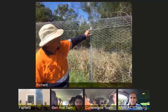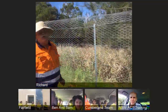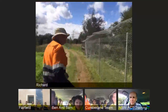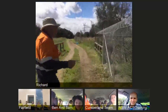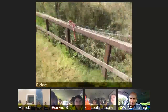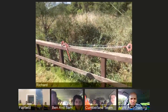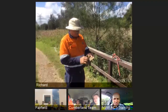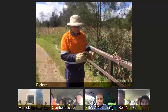The top and the bottom wires are 1.8 metres apart to take our netting. We use gripples to hold the wires together. A gripple is a mechanism of tying two wires together - the wire will move one way through the gripple and not the other. We're also using common wire tensioners. Whenever we're using wire under tension, in case it breaks and snaps back, we make sure that we have at least a five metre radius of people clear from the wire itself.